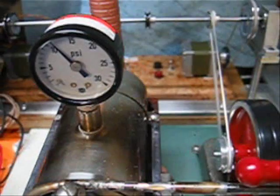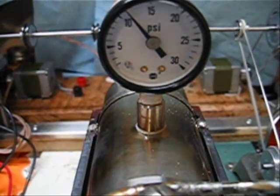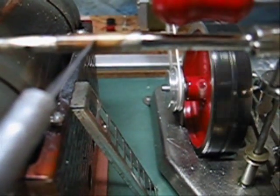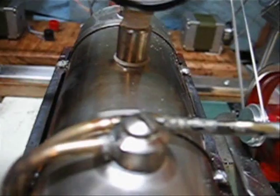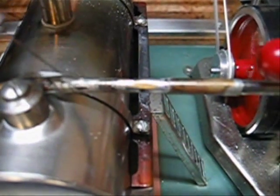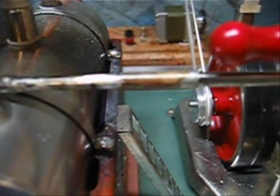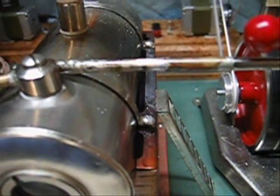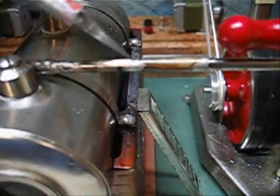I just hooked up my repaired chicken-feed burner to test how it lugs under load. I'm maintaining pretty decent pressure, but I noticed the sleeve covering my old oiler port is leaking. Here's a tip: if you're making one of these, you better silver solder your entire line. At first this joint was leaking — this part was soft soldered, this was silver soldered. This is where the superheater joins the original Jensen line, and everything beyond this is soft soldered. I think the vibration from running at such high speed has conspired to break my joints. So I'm going to have to take this apart, clean it up, and silver solder the whole thing.